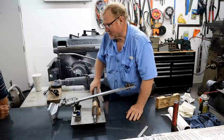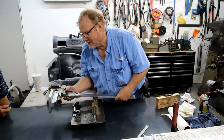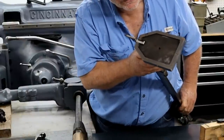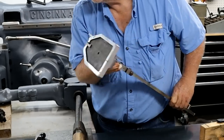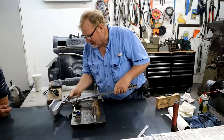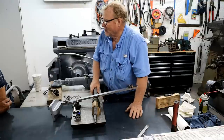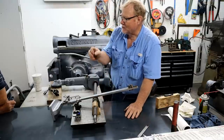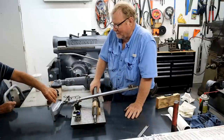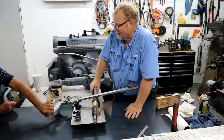You have rust spots on the bottom. Oh, yeah, I see that. That's been sitting in there for months. Well, now you're going to have to do some work on that before it's useful. Yeah, it's pretty rusty. But pitting and high spots, it shouldn't have high spots, should have low spots if it's got rust. The rust expands, and so now every one of those dots is an expansion. The minimum you can do is stone it. Yeah, that's all I'm going to do.